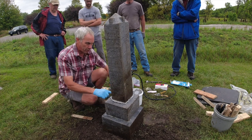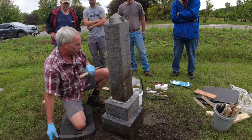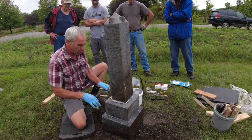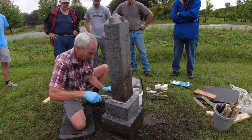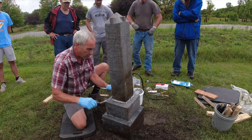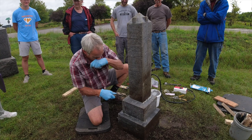Get it to squeeze out and come down to the spacers. Then we're going to trim it. This stone has a wash on it — that's the angle you see right here, called a drop wash on a monument. That's aesthetic but it also sheds water. The wash establishes where this sits. After we trim this we can sight it and see — we can measure it too, but it's really more of a visual thing with a stone like this. We're going to trim it and you'll get a nice even edge.